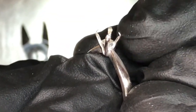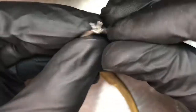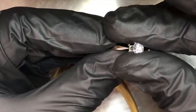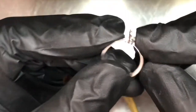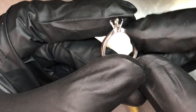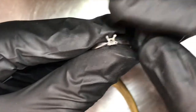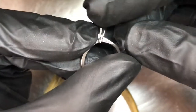Can you see the side there? It's literally right on the edge, which means basically that the person who assembled this particular ring bought the wrong setting, and then the setter set the stone into the setting which was too small for it, which meant that they had to cut it to accommodate the stone. Which is exactly why probably fabric or something caught onto this — and not because of worn claws, but because of weak sides, this diamond came out.